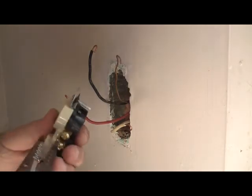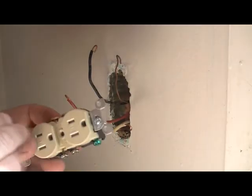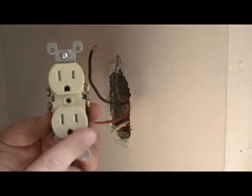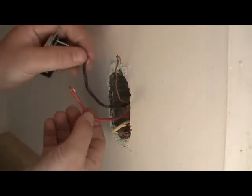There it goes — tab is out. I'll show you on the original old plug — the old plug's tab was broken too, just in case. So removing the tab separates this side from this side. Do not break out the tab on the silver screws — that has to stay, because we only have one neutral wire that has to complete the circuit for both outlets. As for ground orientation, it doesn't matter if the ground hole is up or down — where I'm from we generally install them with the ground on top, but it's personal preference.